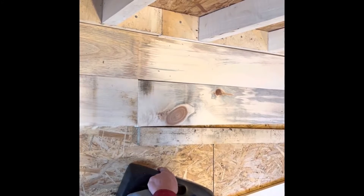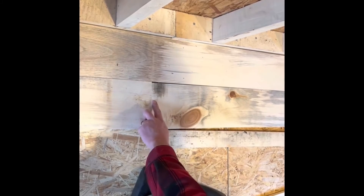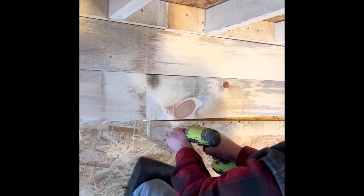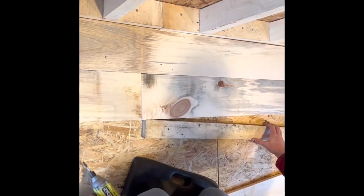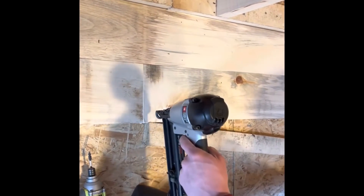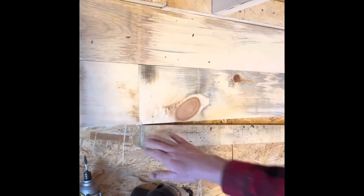As we get this floor going, some of my boards are not perfectly straight. You'll see we've got a little gap right here, and we want to close as much of that gap up as we can. I don't have enough weight to push that, so we're just going to drive a screw right through this board into the floor, and I should be able to bend that right back into place where it goes, and then drive nails in there and she's right back where she needs to be.